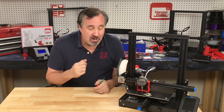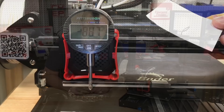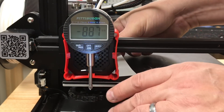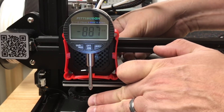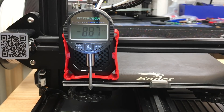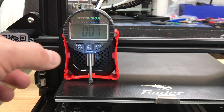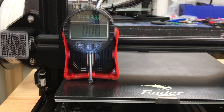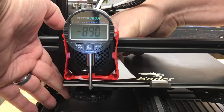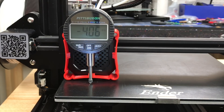This also made me wonder how accurate I am with a piece of paper. I'll do the same procedure but use paper instead of the electronic leveling tool — adjusting until I feel a slight resistance on the paper. The dial indicator will lift and move above the adjustment knob, and we'll zero it there as our base. Then we reposition over the knob, randomly move the knob, and bring the paper in until I feel resistance.